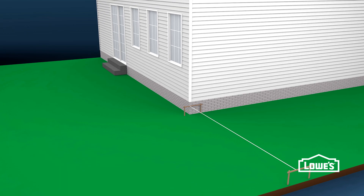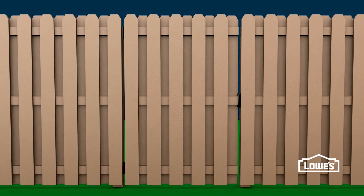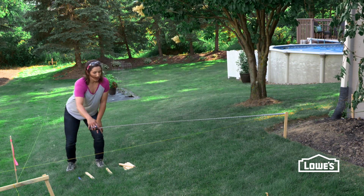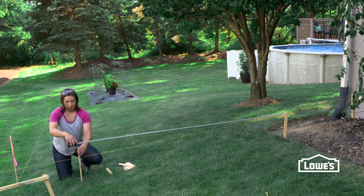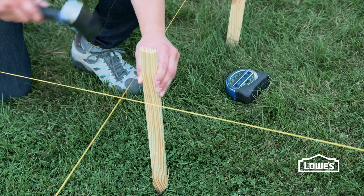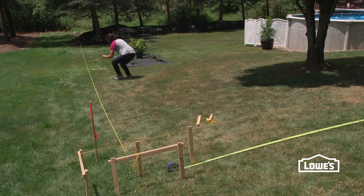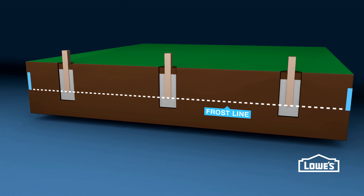That looks good. Also, when installing up the corner of a house, remember to account for rails and pickets — the posts will be set back a few inches from the edge of the house. And when setting posts for panels or gates, remember to account for the hardware. I've started marking my post holes here. I'm going to pull off eight feet and make sure my tape measure is level. Don't follow the slope of the ground or else it'll give you an inaccurate measurement. I'm going to place my stake at eight feet and eyeball half the thickness of my post. Don't put the stake directly next to your line or under it. Typical post spacing is between six and eight feet. Local code will determine post hole size. The depth should be below the frost line to prevent heaving and the diameter is typically about three times the width of the post.